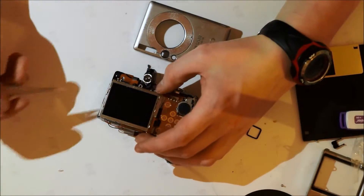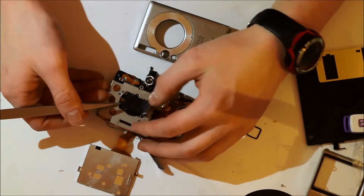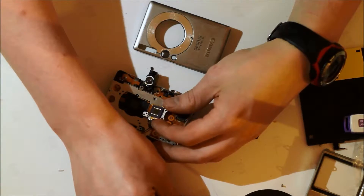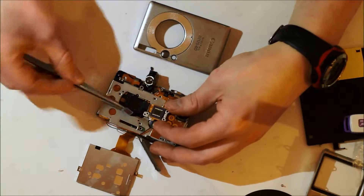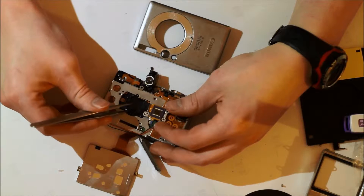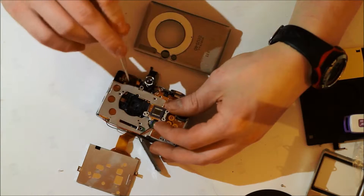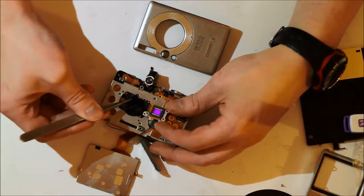It's just under the LCD. You just need to remove three screws and you'll be able to access the sensor itself. In front of the sensor is an infrared filter, which I have removed and replaced with a piece of diskette film, which happens to be a nice filtering medium because it blocks visible light but not infrared light, so it should work.